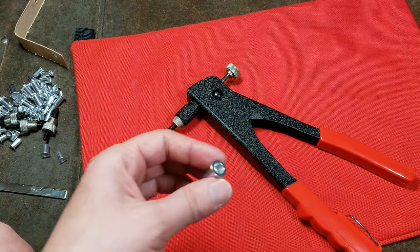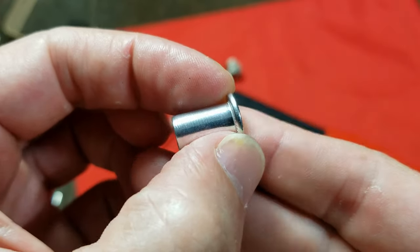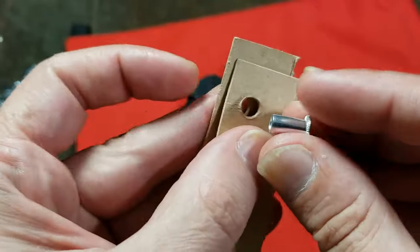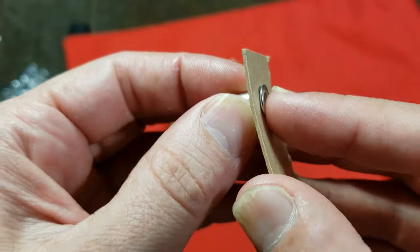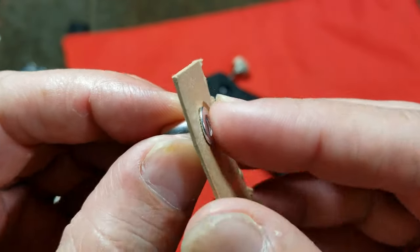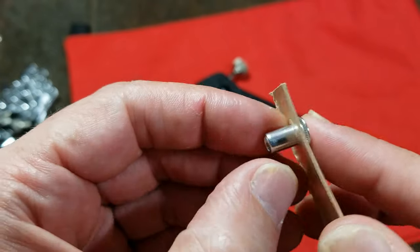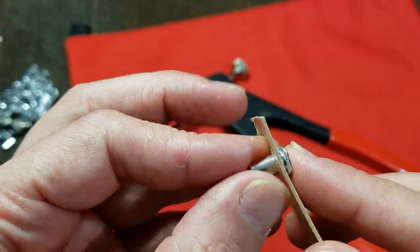Online there are larger versions of these available. How these work is actually similar to a rivet. You have a little shoulder here, and it would just get inserted through a hole — say in a piece of sheet metal. Then this special collar or threaded chuck threads into there, and when it rivets, there's a little blank area at the top. What happens is it threads into the threads at the back and squashes it, making a little bit of a bulge, holding it in place.